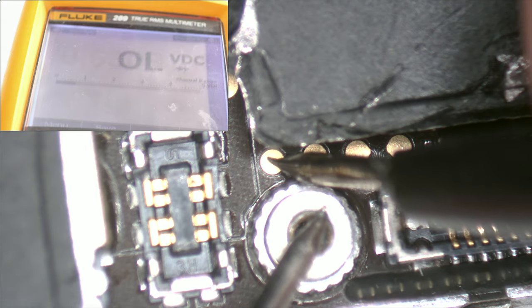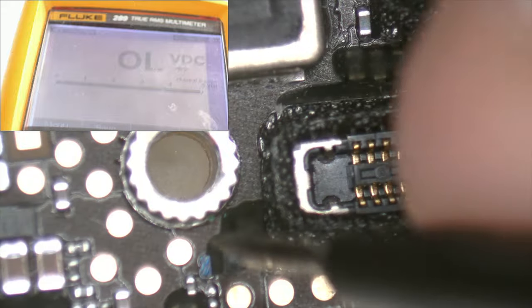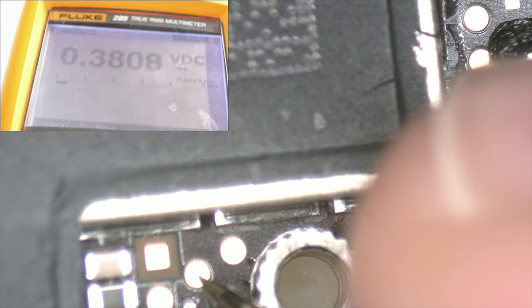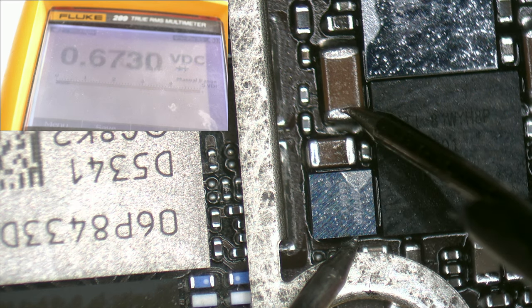If we don't have a thermal camera, we can use the rosin technique. There are plenty of tutorials on the internet. Next, we rule out the problem beginning in the U2 component. We have a series of videos that explain how to measure this component and determine whether it is working properly or not. I will leave you a playlist on this topic above.